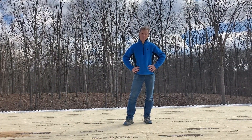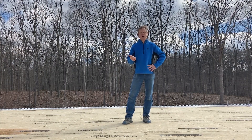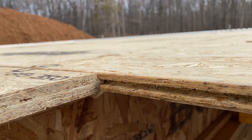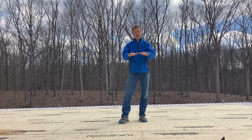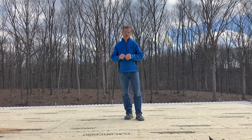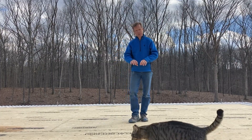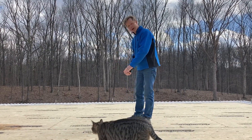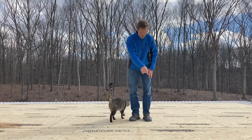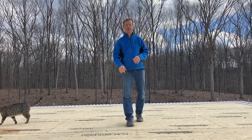I'm standing on the subfloor now. The subfloor is like any other house — it's usually OSB or plywood, tongue and groove. When you put it down, there's glue on the I-joists, then you lay it down and nail it, so it's glued and nailed. That makes a very tight fit to prevent squeaks in the floor. They also take a two-by-four and sledge it to push the panels together tight. These are actually pre-gapped so they fit together nicely but still leave a small gap for expansion.